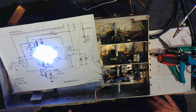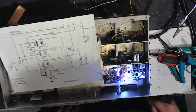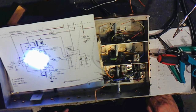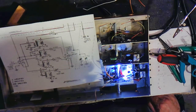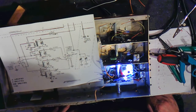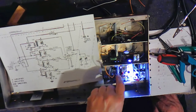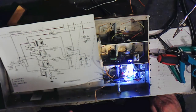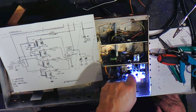Okay, so band 3 has 3300 installed to position 3 on the switch, which is down there, it's hard to see. Then it has a 10 ohm resistor at the center tap, which is C. D. You're connected to E, which I do not have a lead for. I'm going to have to put one in.